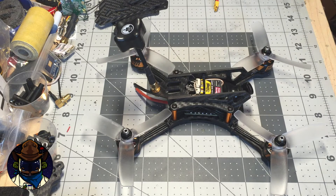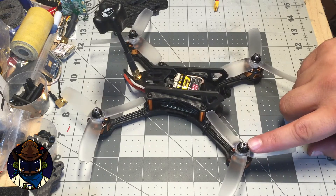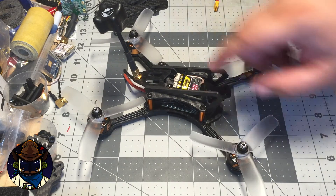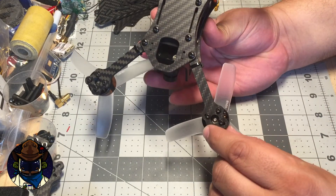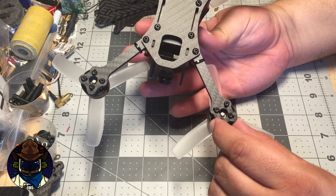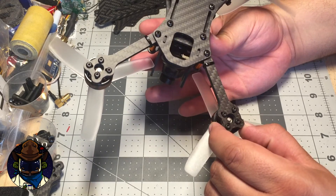I've got the F40s, the F60s, and the new F42s, and they've all been great, so I wanted to try the F30s. These are probably some of the nicest 1806 motors on the market. They have a steel shaft that's hollow for the lock nut to go on, but that steel shaft also goes down into the bottom. Unlike most 1806 motors that have a 2mm shaft, this one looks like it's at least 3mm.